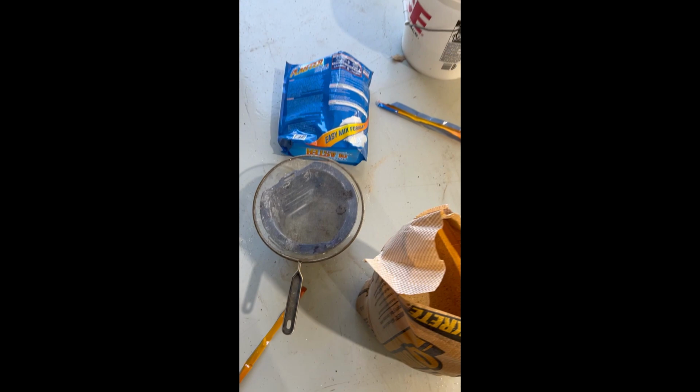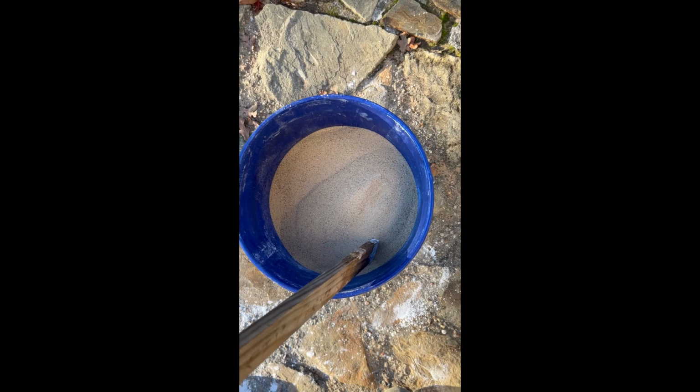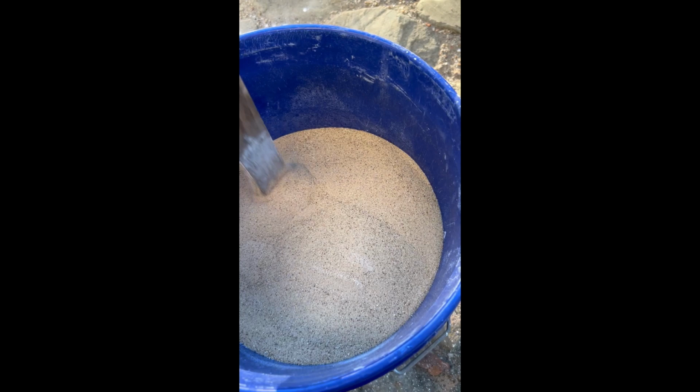See the rebar I'm using in here. Let's go. All right, I got my 2 buckets of sand and my 2 buckets of plaster in here now. Took a little bit longer than I would have liked. That was really, really coarse sand. I really should have just bought play sand. In the future, if anyone wants to copy this, do not get the Quikrete all-purpose sand. It's meant for concrete. So, really not sand at all. Probably about half gravel by weight.